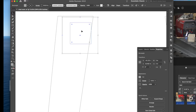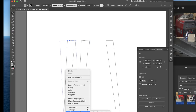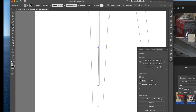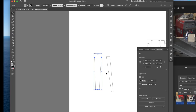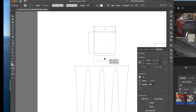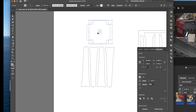I use the big trapezoid as the bottom and the little one to cut through it — that's how I end up with the left and right legs. I add a little flare piece just to give it some style, pull out that fillet. Each one of these legs makes up the corner of the stool. I bring them close together parallel, back to back, throw a strip over to connect them. I join them completely and now I have one compound path — times four becomes the four legs. I make the top: 12 by 12 with 12 by 3 inch flaps that bend down, and a hand hole in the middle. The rungs are just simple rectangles. My final palette is exactly 48 by 48 inches, so I know exactly where all the parts land on the material.